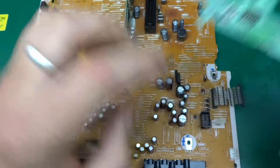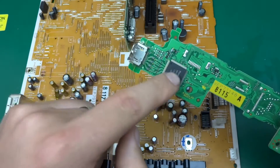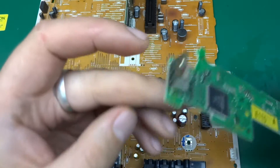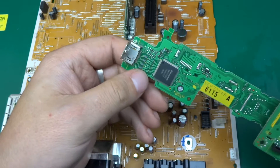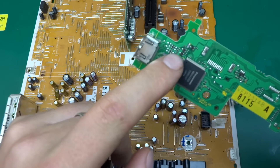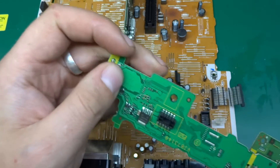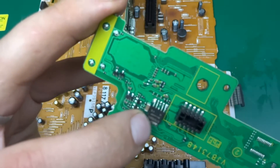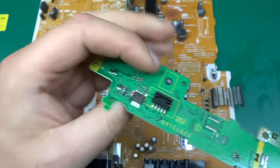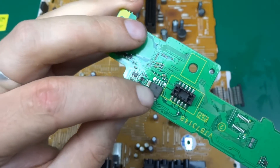Here is another board-to-board interconnect that plugs into this socket here. This little board is purely HDMI output — it has a proprietary Panasonic chip doing the HDMI communication. You can see the differential pairs going into here, and those tracks are probably audio. So there's got to be some sort of audio amp on here. This one here is actually a voltage regulator: Sharp 070 XNA1, going from 1.2 to about 7 volts. That's pretty much very reusable.